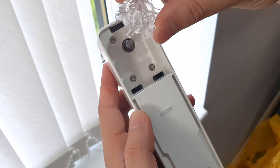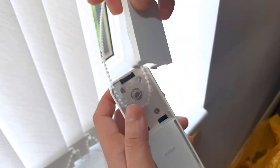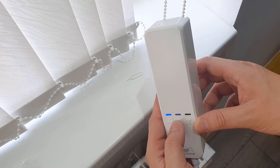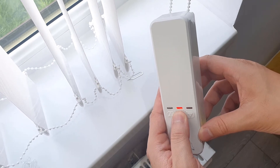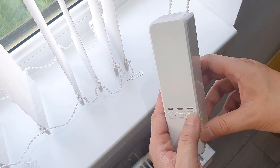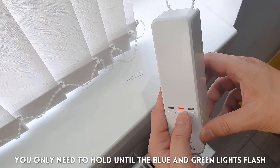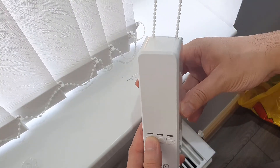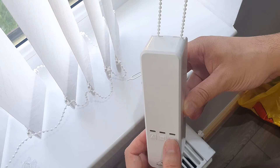Before installing the motor to the wall, do a pre-test with the motor in hand in case something goes wrong. Slot the cog into the enclosed space and wrap the beaded wire around the cog. With the blinds in the fully closed position, press the up button to start opening them. Hit the stop button at the right moment, then hold down stop for 6–8 seconds to store the value. Do the same for the down button — press stop, then hold stop for 6–8 seconds to remember the closed position. The LED indicators will flash to confirm. You can adjust this after wall installation, but it's safer to set and forget before you start drilling.